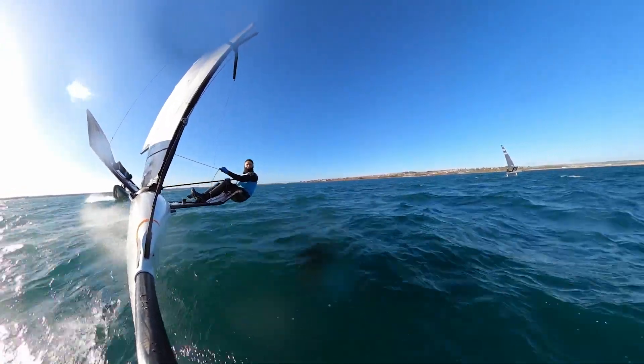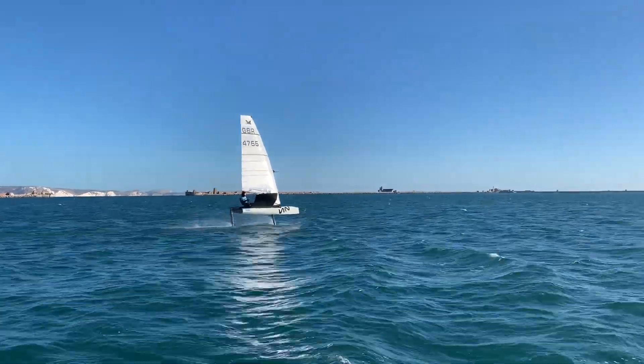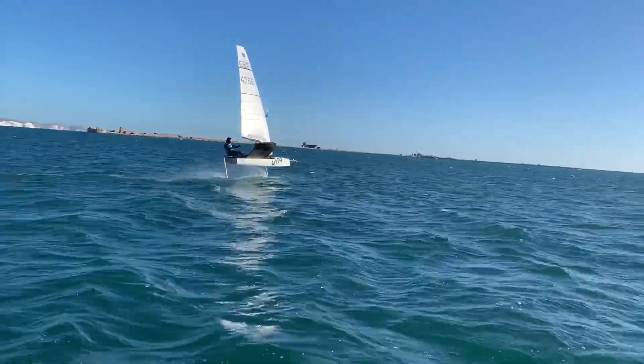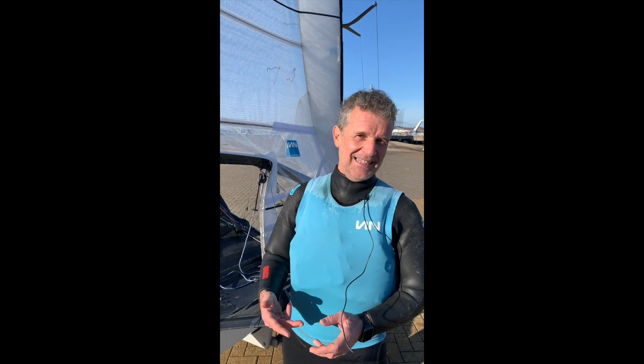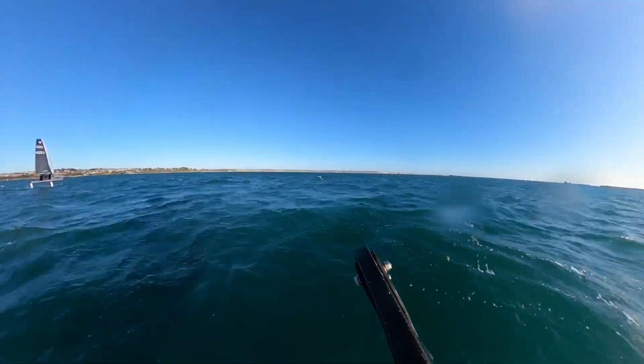It aids repeatability, so when you get into a fast mode you can just glance at the numbers it's giving you. You can look at the speed over the ground and you can look at the heel angle. You can also look at the load on the vang, which we had set up today. The boat's very dynamic — going upwind and downwind — and when you go back round the leeward mark, you can hit that setting immediately and you're straight into the fast mode.